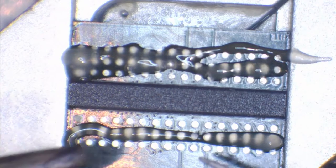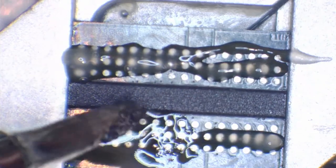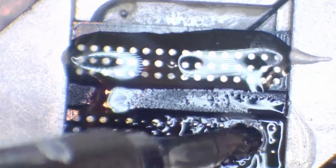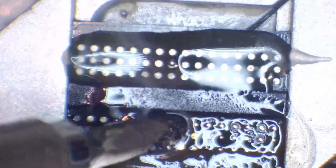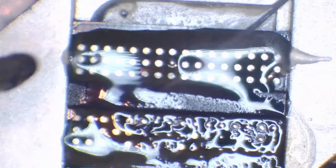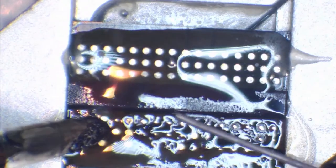Because we've got some oxidized pads, and you can do this anyway, this is just best practice really, I'm going to apply some solder to the tip of the iron and pre-tin all of these pads. And you might see these solder balls here and think, oh yeah, that's job done. But it's not, because these solder balls are going to be uneven, random in size, one bigger than the other. Well, you could do it like this, theoretically, yes. However, it's not viable. It's going to take far too long, and you don't want to do it like this.